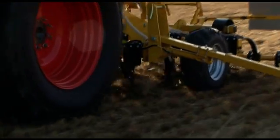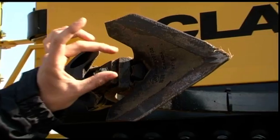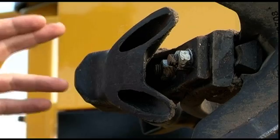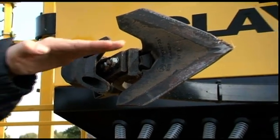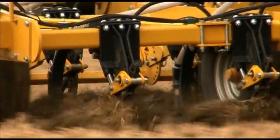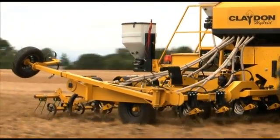The machine uses a tine system on the rear for seeding. It's an interchangeable coulter and can be from anywhere from seven inches right down to a singular inch — so seven, five, three and one inch. The seeding boot at the back is also interchangeable. This is the splitter boot. It splits the flow of seed either side of the drainage channel created by the front tine, leaving the seed on the banks and spread across a wide seven-inch band. This would typically be used with the seven inch and also the five inch coulter.